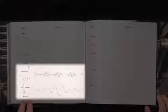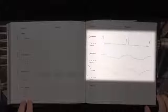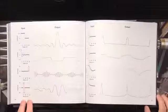On the left, we've input a sinc to produce a square wave, and some frequencies to produce beats. On the right-hand page, the top three inputs are Bessel functions of various parameters. Keep in mind that we didn't use the same translational gearing for each calculation. You can determine what gearing we used by just counting the periods. For example, the plot on the top of the left-hand page was made with the medium and medium gear combination, shown on page 57, because it has one period, while the graph below it, the square wave, was made with the large-small combo because it has two periods.